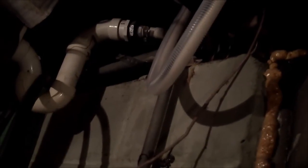So this is a standard, ideal hose clamp with a 5/16 hex on it, and we'll just tighten that up, and that's going to be the end of the installation there, because we got the water on, we're ready to test. What I was trying to say earlier is the strainer for that water supply is down in the solenoid fitting that's downstairs. So the strainer is actually very easy to access down the road when it comes time for you to clean the strainer, because invariably that's going to get plugged with stuff.